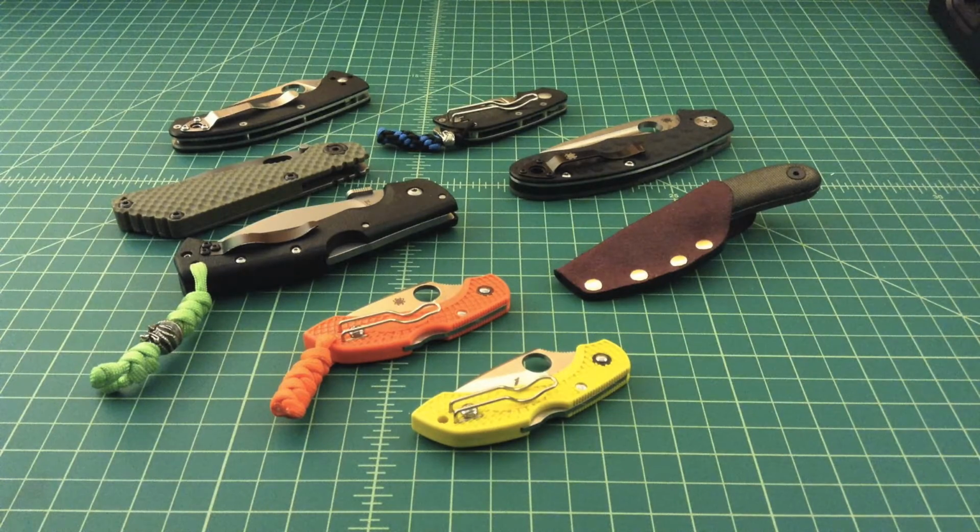So anyhow, I wanted to talk about some of these premium steels and why the knives cost more money. And it's not just because they're buying better steel or premium steel or super steel, which costs more to make, so in turn the steel costs more to buy if you're a manufacturer. But also, those steels have longer edge retention because they're more wear resistant. And because they're more wear resistant, it takes more effort to fashion a steel bar into a shaped blade. You have to grind it, and it takes longer, and if you're using a grinding stone or a belt, it will wear out faster. So it's actually a little bit tougher to manufacture as well.